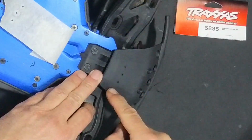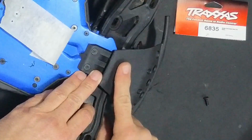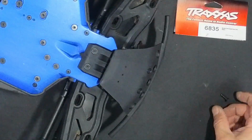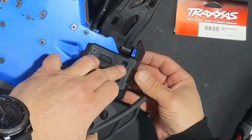Voila! Now you drill them through, so the screws fit. Then you countersunk a bit, and then it's flush. So these are M4s, so we need a hole of 4.5. Let's see how it is with 2 holes.